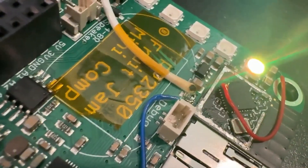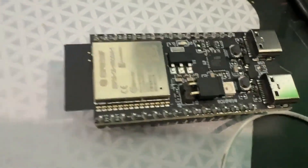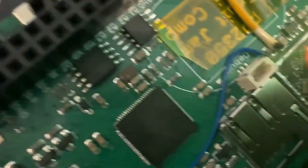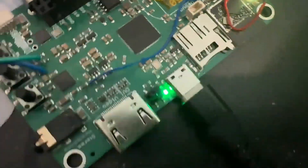The one thing I wanted to get working this week is the ESP32-C6, which you see here — same thing as this dev kit, and we also have a Feather with a C6 on it. What's nice about the C6 is it does Wi-Fi and Bluetooth, it's very low cost, and it's very small compared to the ESP32 Classic. It doesn't do Bluetooth Classic but it does do BLE.